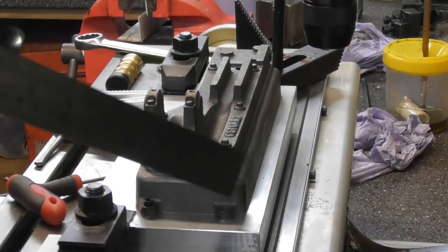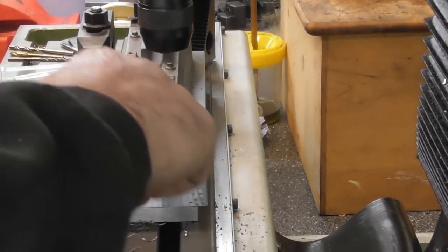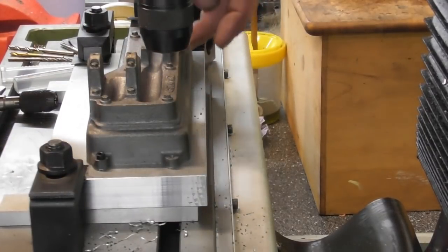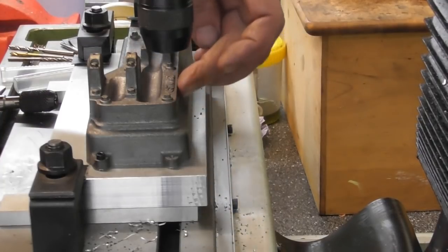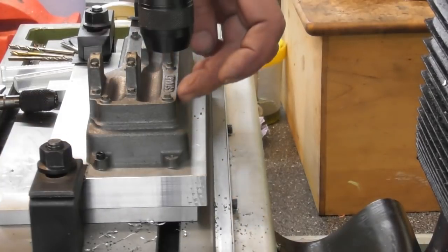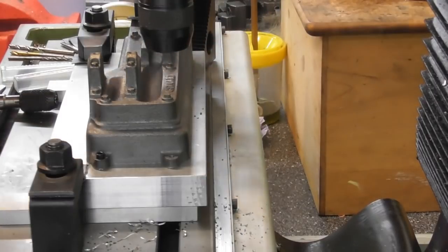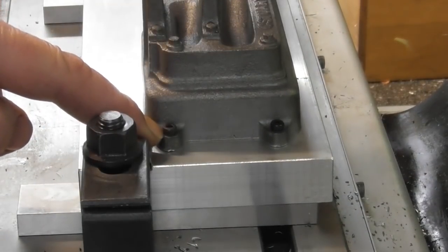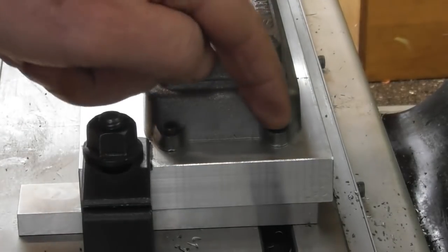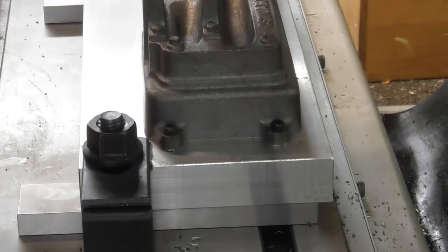Then the final hole: I take the clamp off the end and repeat the operation — find the centre of the third lug, clock it in, drill clearance and tapping hole. I've got a variation of about five thou along the clocked face — it sort of wandered up and down, but end-to-end I got as close to zero as I could. Here we are with all three M3 bolts in. These will be changed to 4BA — I'll whip them out one at a time when I get the new bolts and spot-face the top, open them up to 3.7mm, re-drill and tap to 4BA. That's for the future.